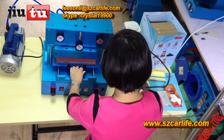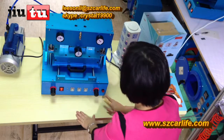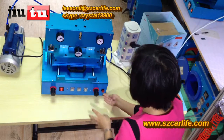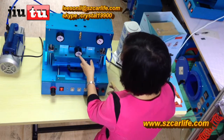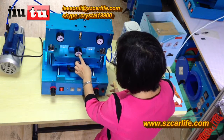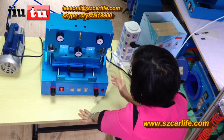Please notice that while you press this button, you have to make sure that if the vacuum starts to move to the second degree, then you can release your hand. If you do not wait for the vacuum to reach that degree, it will bounce back very quickly. So make sure you press and hold this button until there is a value showing here, then you can release both hands. Wait for about 15 seconds and it will release automatically.